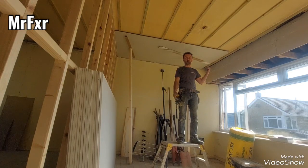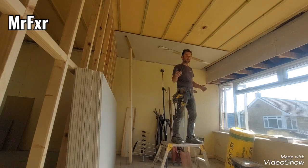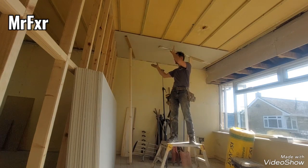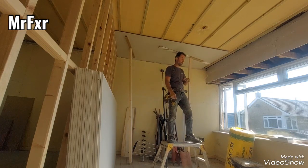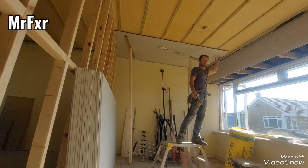Extra time spent on cutting, extra time spent on fixing the battens. All in all, you're probably losing maybe 300-400 pounds just by fitting ceilings differently. The way I do it, I just put a sheet up. Start from one corner, against the wall, nice and square, and I put it up. Then I use an offcut of the batten, and I place the offcut there, halfway over the edge of the plasterboard, fix the plasterboard to it, fix the batten into the joisting, and then put